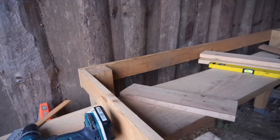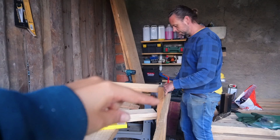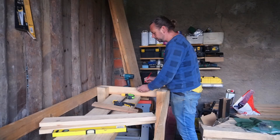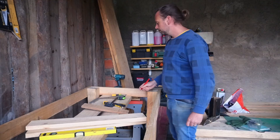The frame is done. Now we need to add supports before putting the top on. Omar is thinking about adding diagonal braces in each corner — not triangles exactly, but diagonals. Because this is a worktable with lots of movement on it, over time the joints will get weak if moved around a lot. Getting some triangles in the corners would certainly make a massive difference.